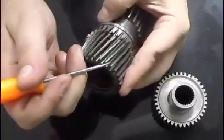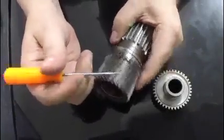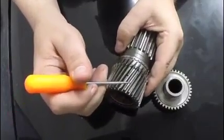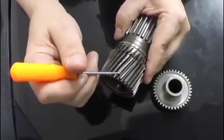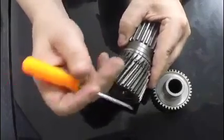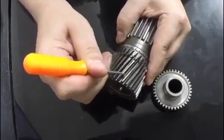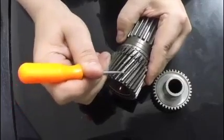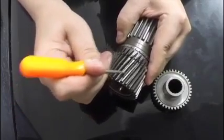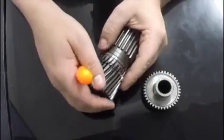I'll find you an example of where this is bad. My suggestion is to take the sun gear out into natural lighting — even on a cloudy day, walk outside and get that sun gear in open light. You'll be able to tell right away if the hard facing is gone. With a pick or scribe, if you gently touch the surface and it hangs up or sticks at all, that hard facing is either gone or starting to go.